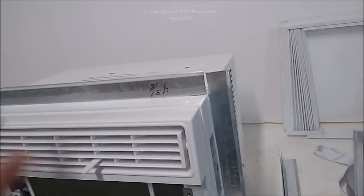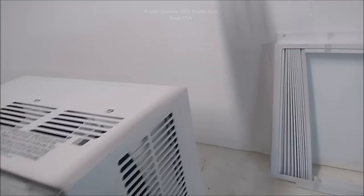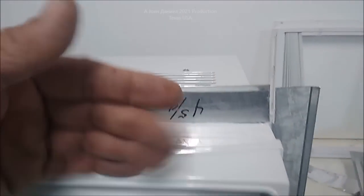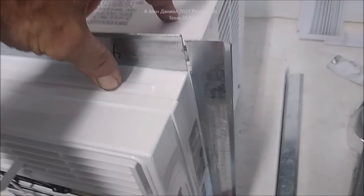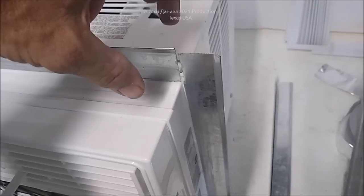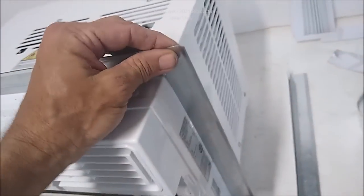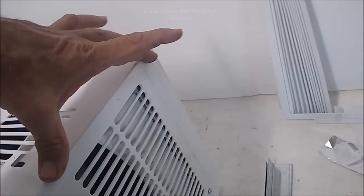Be careful disassembling — the top will come off. You'll just pry a little bit on both sides of the upper case. Those two screws up there come out — they're part of the fan shroud holder — and you just slip it off. It's just a big piece of sheet metal. Do your measurements before you remove this — you'll see my pen marks everywhere. Once you make your measurements of where in your wall you can put it, you're good. Stay a good eighth of an inch back. For a travel trailer, two and five-eighths inches — you're fine. This unit is just under three inches total thickness.